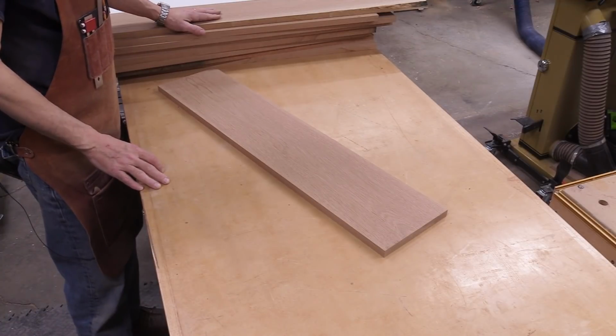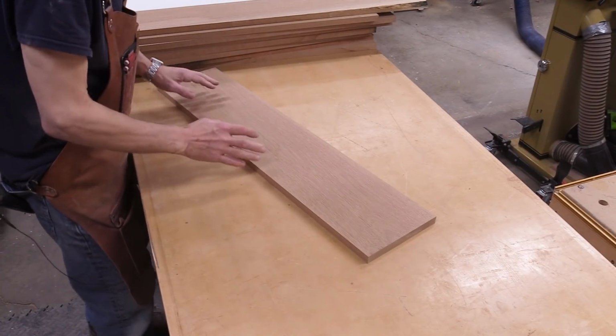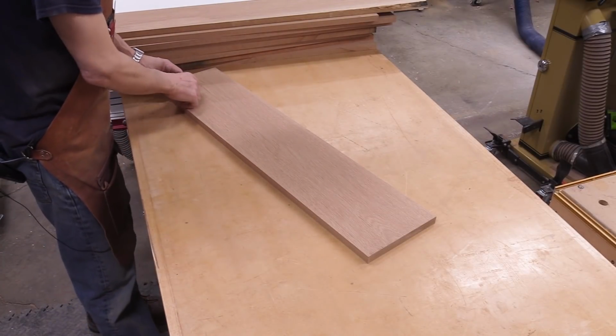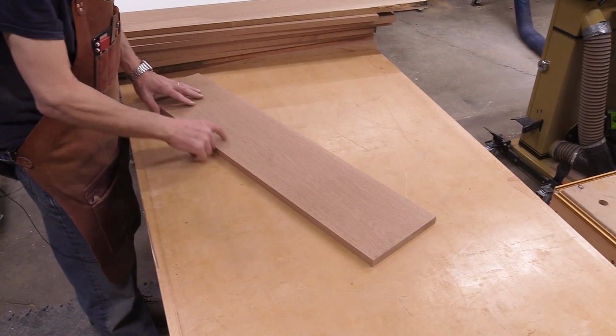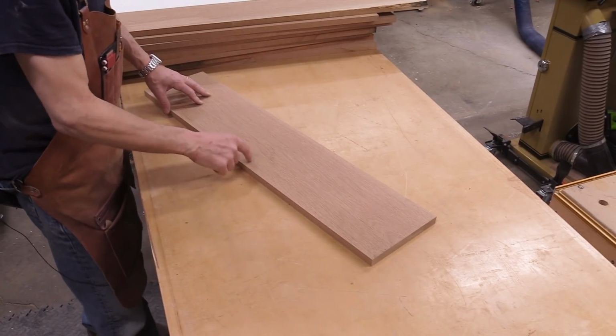All the wood is milled up to 3/4 of an inch, and this is what I'm left with. This is pretty representative of most of the pile. This is almost all rift sawn. What I really want to do is get 2-inch strips out of all this very, very straight grain. I'll move the camera and you can take a closer look at this board.